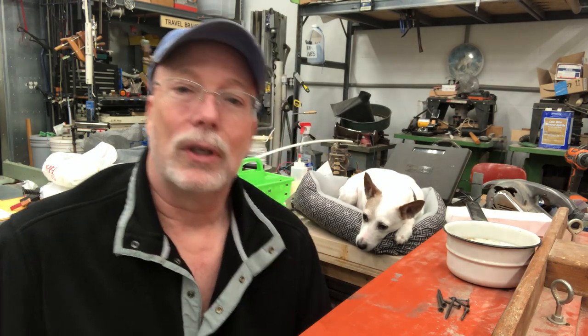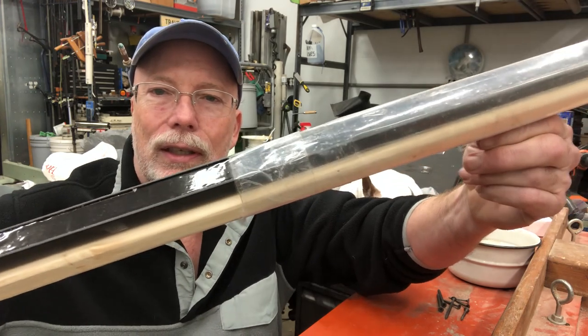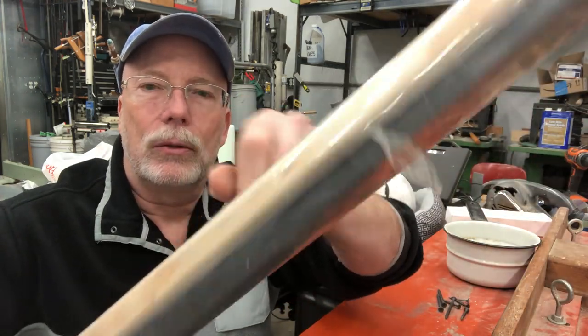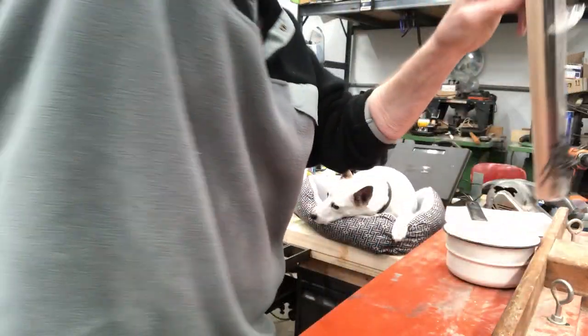If you're working in the shop, piddling around, you're going to be working with nails and screws and sheet metal shavings and grindings and all kinds of stuff that you don't want to get on your hands. So you have to use a magnet to get that stuff cleaned up. I've taken this magnet from Harbor Freight Tools and covered it with plastic and sealed up this end. Put a little piece of tape right on it — it's kind of like a stopper that will push the stuff off — and put a little tape handle on the back. So what you can do is slide this off, get your mess up like that right there, and then wherever you're going to put it — garbage can or whatever — you slide it off.